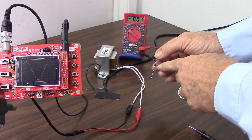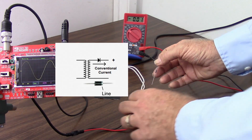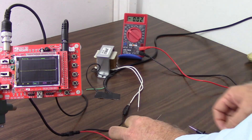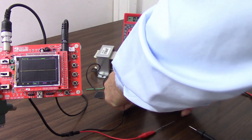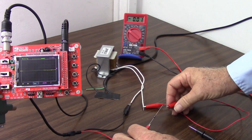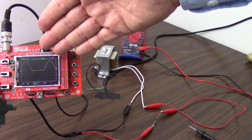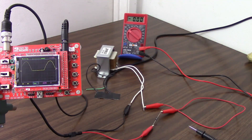I will get my positive voltage at the cathode of the diode, which is indicated by this white line right here. So let's take the oscilloscope's red lead and put it on the cathode, and I will use a clip lead to hook up the transformer to the anode. And now we look at the oscilloscope, and you see we have removed the negative side of the sine wave.